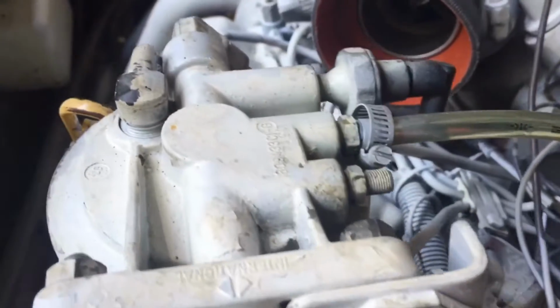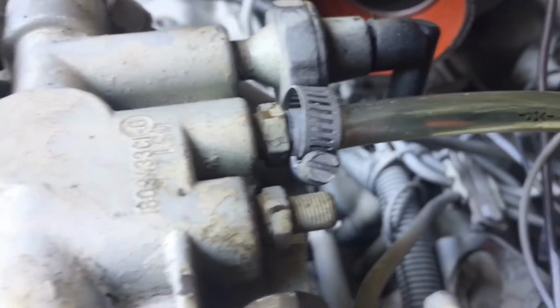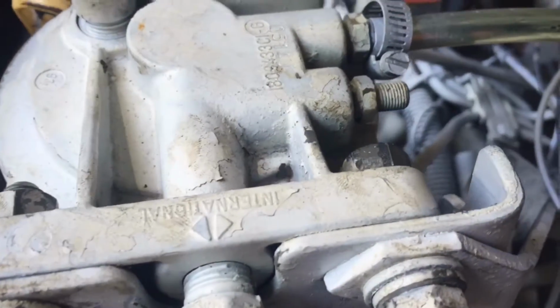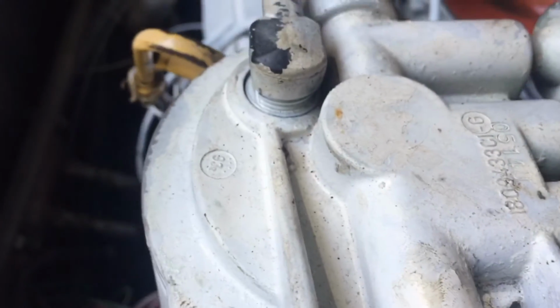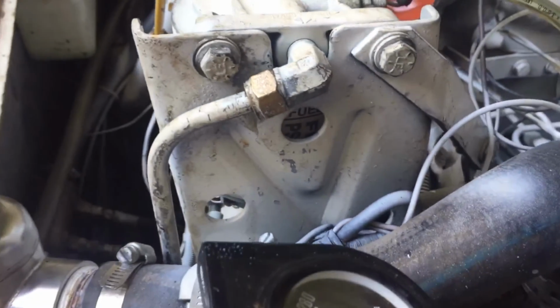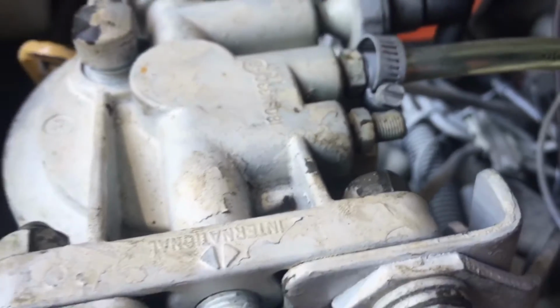The only thing, fuel comes to that tube through this little piece here, circle. It's got another little cap here for a Schrader valve, and then it comes into the filter. Comes out of the filter and goes down to the high pressure fuel pump down there. So, with air showing up right here, it has to be before this.